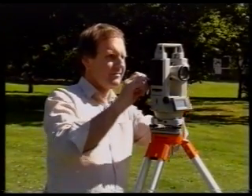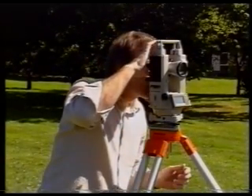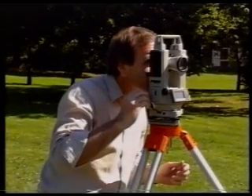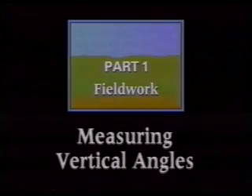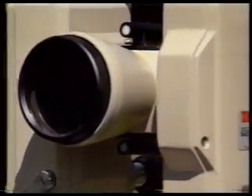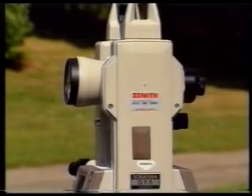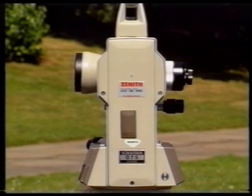A fourth round would have an initial reading between 270 and 271 degrees. This then completes the procedure for measuring horizontal angles. Although electronic theodolites have greatly simplified angle measurement, it is still advisable to take vertical angles after completing horizontal angles to avoid any confusion when booking the readings.